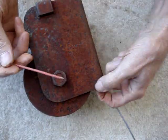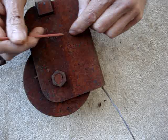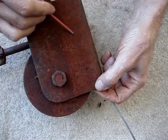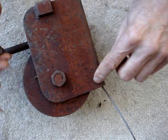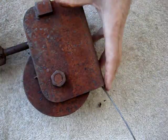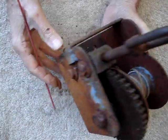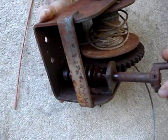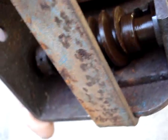What I'd probably do is cut and grind a replacement piece to shape, leaving enough material for the bolts so I can get it back in place. Then use half-by-one national coarse bolts — maybe one there, one there, one there. I haven't figured it out entirely, but that's the plan. Whether or not it'll come to fruition remains to be seen. Look at that — a lot of free play in there, that's not a good thing.